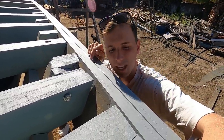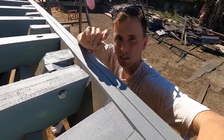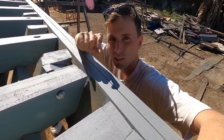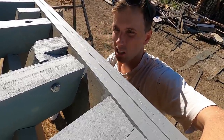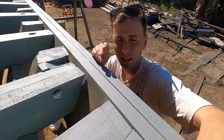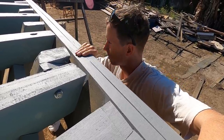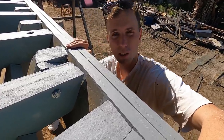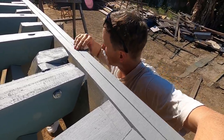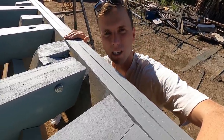As you can see, there's quite a gap in the middle here. So what we're gonna do is we're gonna caulk it so we've got 1 centimeter or so above the caulking, which is still gap, and fill it with araldite, which here is a bicomponent epoxy that you mix with sawdust, and it'll imitate the effect of wood, as it will be quite flexible as well with the sawdust. And that's going to cover this hole, and then we can start putting the tabica on top.